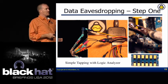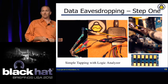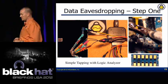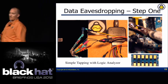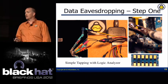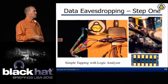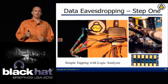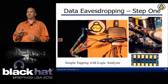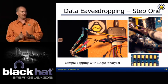So what I do is I look for the debugging ports, the debugging pads, as you see in the bottom right-hand corner. Normally those are broken out to program a microcontroller, to interact with memory. But what this one is, that you see right here, is it's breaking out the connections between the metrology board and the daughter board, the network interface card.